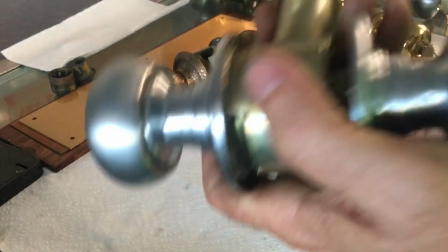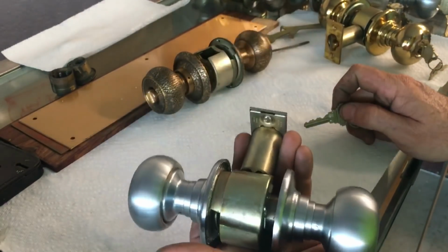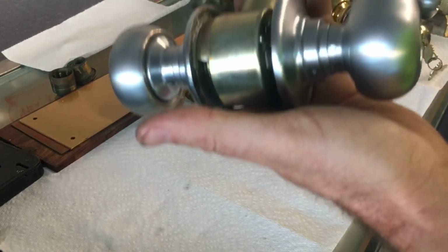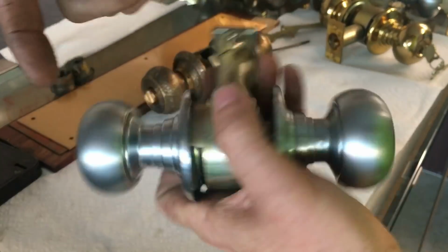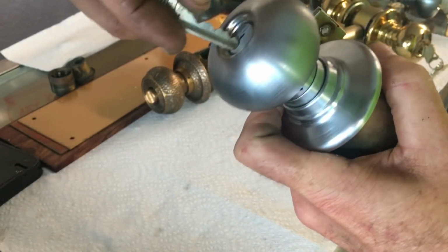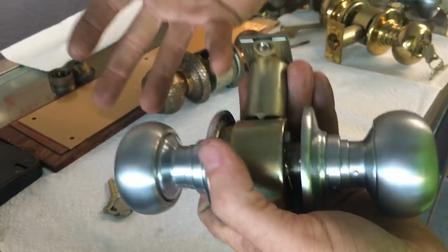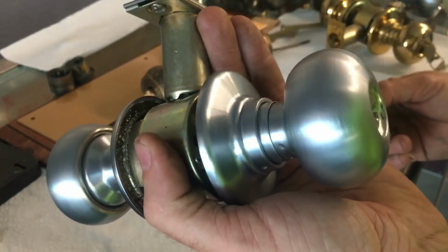This is very rarely used, and almost always only used in a prison setting or hospital setting where there is somebody on call that guards that door literally all the time. And it functions like a classroom function lock. So just assume that's the inside of the door. It's unlocked, it's locked on the outside. If we take our key, turn it all the way in a circle and pull it out, it's locked on the inside and on the outside. Obviously way against fire code, but again, this is rarely used, only used in institutional type settings.